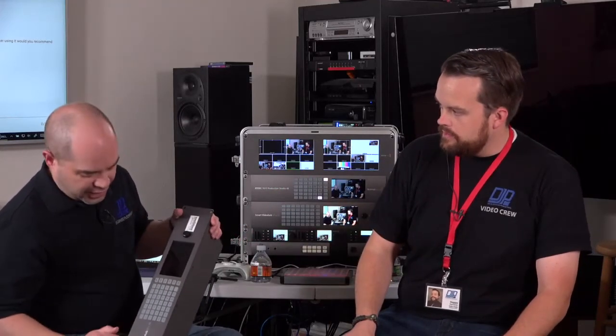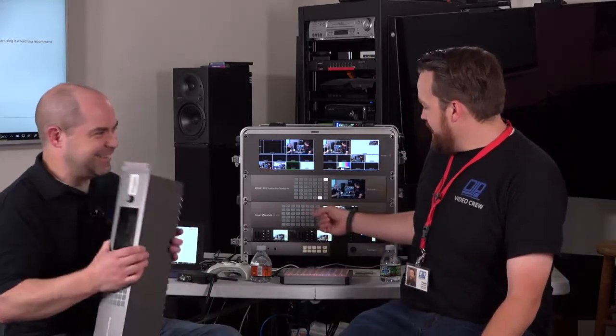That other one you were talking about that had 12, what's that model? They're all called Smart Video Hub, and then it's 40 by 40 or 20 by 20 or 12 by 12. And the one that's a clean switch is just called the clean switch 20 by 20 or 12 by 12. It has all the same routing capabilities, just fewer, so you can hook up 12 sources and output to 12. For most people, a 12 might be enough. It's hard to say. For me, one 40 by 40 wasn't enough. If one is good, two is better. Like I said on Paul's channel the other day, why buy one when you can buy two at twice the price?